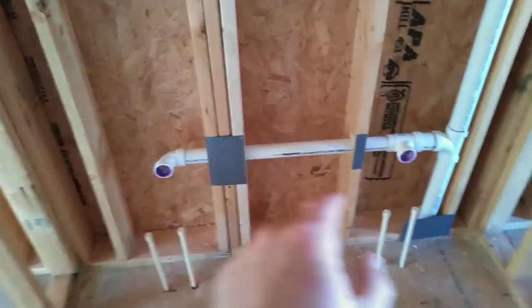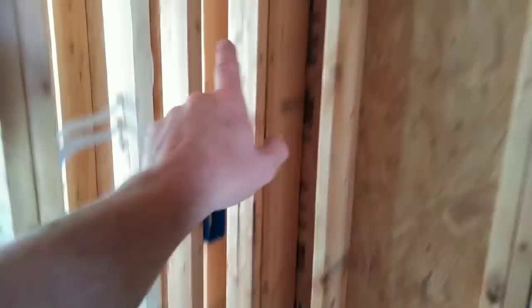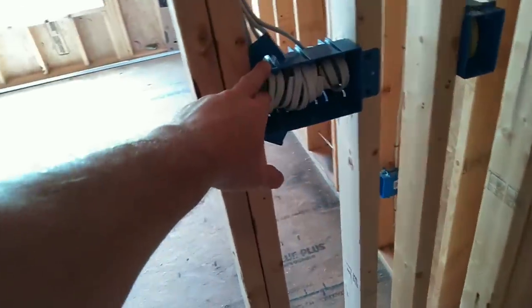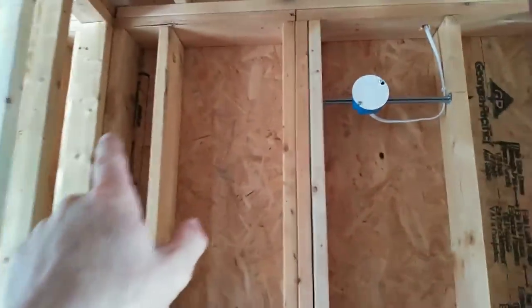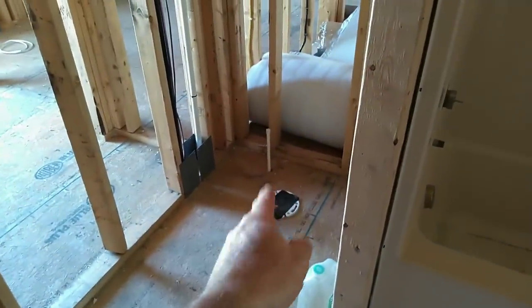Got the main outlet — it's going to be a GFCI. It feeds up, over, and down to have an outlet on this side of the counter. Same as the other bathroom: vanity light is on a slide rail that can be adjusted, centered in the space. The second switch is for the light on the exhaust fan, and the exhaust fan is located in the — you can figure out what that's for.